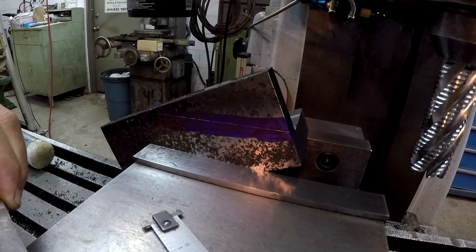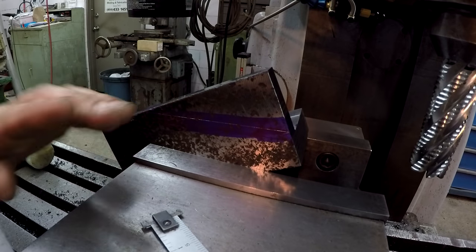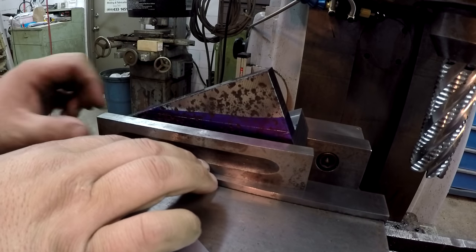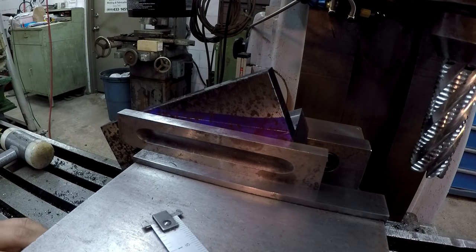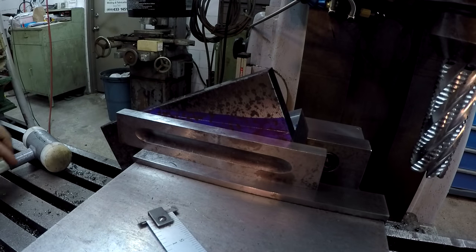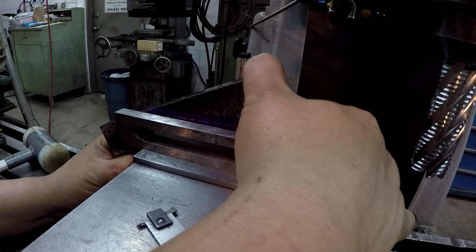I'm setting up the piece back in the mill vise with the vise just barely tight, just enough to hold it and keep it from moving. This is the line we want to make parallel and remove — nothing critical there. You can just take any kind of nice square block, a tool bit, a parallel, wherever your height needs to be. I've got it positioned with the back end about even where it needs to be.